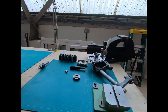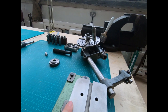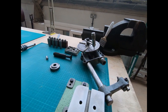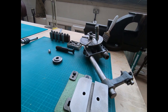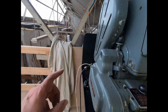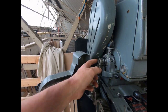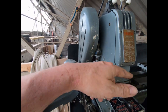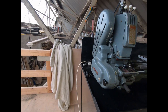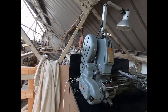On the dividing head - in my Myford playlist I will do something with that and make a video on it. I've got an attachment that goes on the compound slide which allows you to fit it on there, but I've also got an additional one which I'm hoping to fit something to here that will connect through to the spindle and allow me to do the indexing of the chuck - using equipment I've already got rather than buying even more.